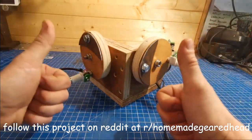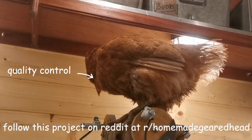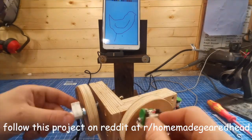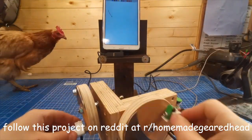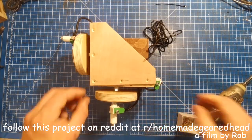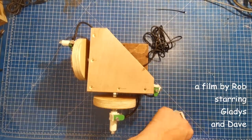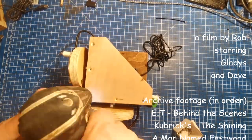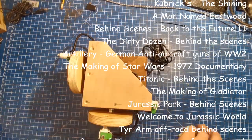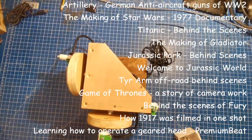That's pretty much everything, so it's time to test it. I've been using a paint program to check everything is running nice and smoothly. You might want to adjust the bands a bit — too much tension and the plastic rollers start sticking and you get a juddering motion, so you might need to lift the mouse up and put some washers underneath. Each one's going to be a little bit different; the dimensions I've given are just a guide to get you started, and the parts I've used are just what I had in my shed at the time, so I fully expect there to be better alternatives out there.